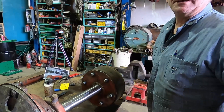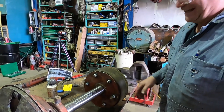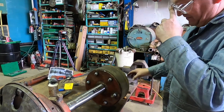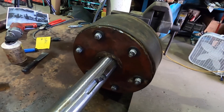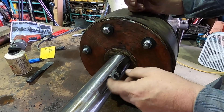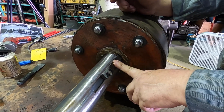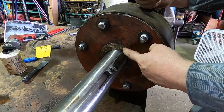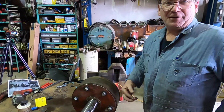There's a chance that next time, because it won't be a real close fit when driven in, they're going to have to put a spacer in here and use a pry bar to pull against it. A lot of times with these they won't come out — usually they're positioned so it's coming out the other side. But they wanted this to be solid shaft for a bearing on this particular side. These set for many years, everything gets rusted, and this will not come out without pulling it — like in this case where it was driven in all the way with no real way to get it out.